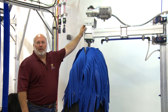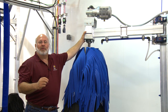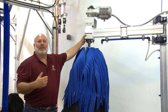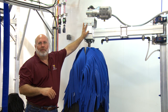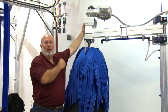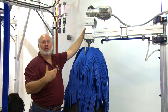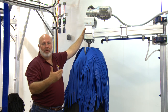This one here is an electric version. At Sonny's, we know there's sometimes a real need to save power and add more equipment, so we've designed our equipment to be universal. It can be set up to run with an electric motor as this one is today, or we take this motor off and drop a hydraulic motor in and we're back to hydraulic. If you have hydraulic and want more cleaning power but not enough electricity, we can convert some hydraulic to electric and actually add some equipment.